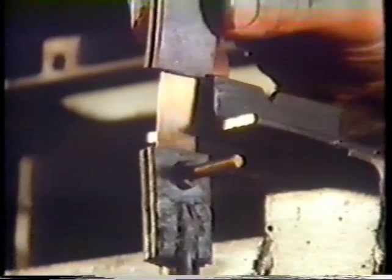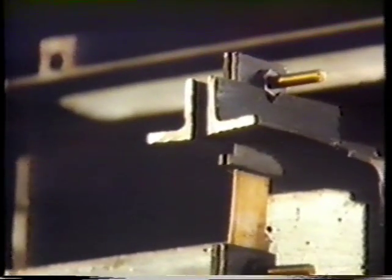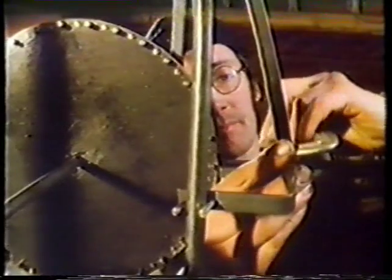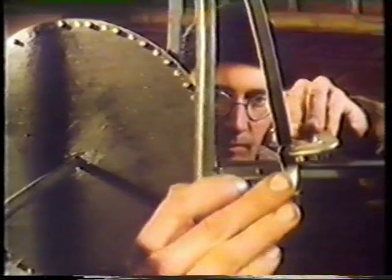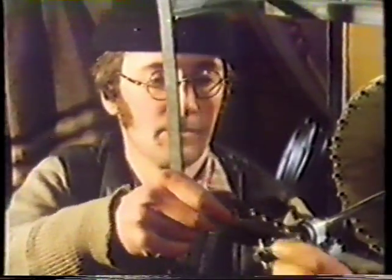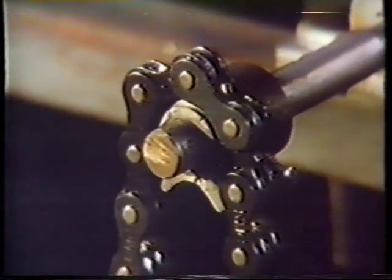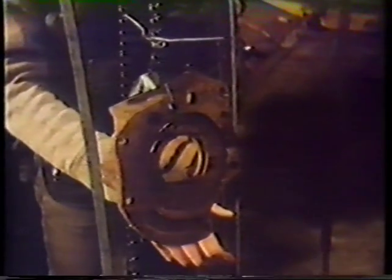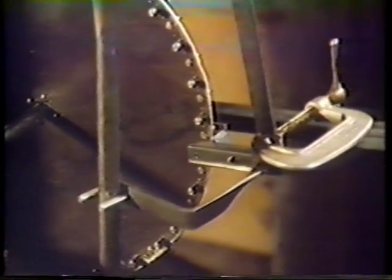Day four — Tim pressed on, hoping to get the clock ticking. Often by this stage of a project it's good for morale to see something working. He made the bar that holds the pendulum weight, with a bit of clock spring at the top that fixes to the frame, allowing the pendulum to swing from side to side. Then he made the crutch, which attaches the pendulum to the pallet so that as the pallets move side to side, it gives the pendulum a push. With those made, he tried it out with a temporary weight on the end of the pinwheel shaft — and it didn't tick. He tried fiddling around with it and it still didn't seem much better, so he gave up for the day. In the evening he looked at some reference books, and that gave him confidence that it would work eventually.